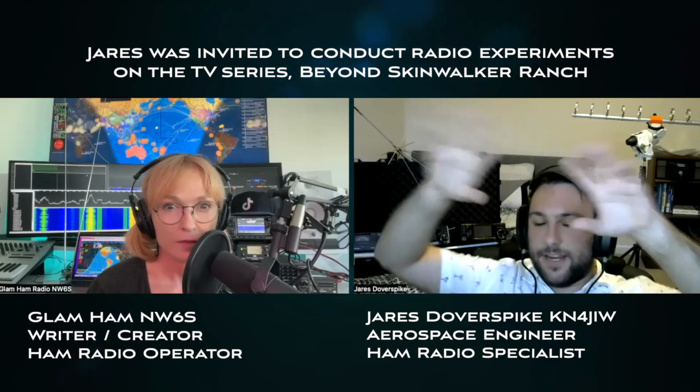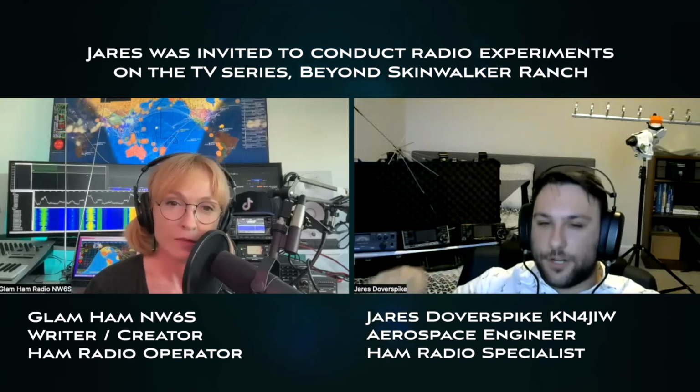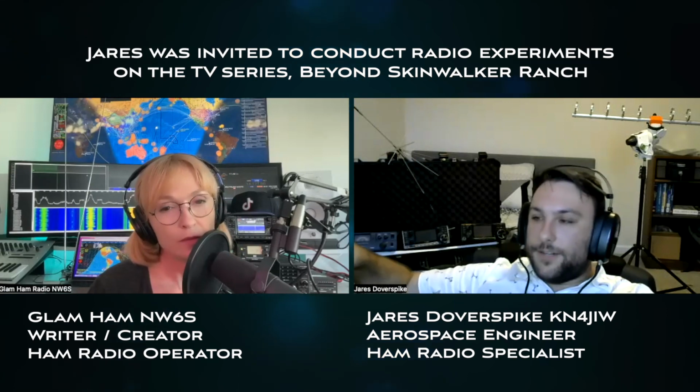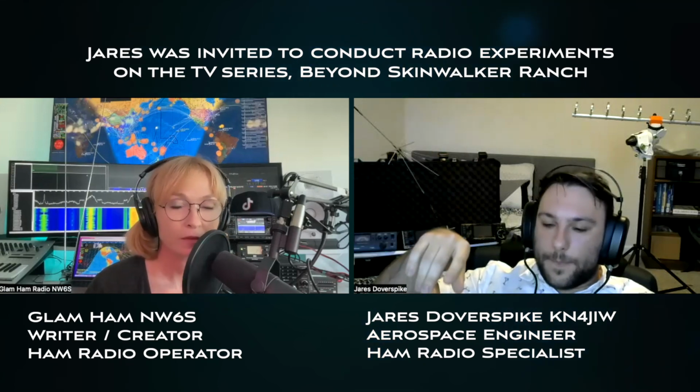I saw your standard kind of spurious signals. I saw a couple of what I would assume to be satellites because I was seeing the Doppler shift. Like, if you zoom out a little bit on your RTL SDR, sometimes you'll see different signals that go one direction, kind of flatten out, and then move in the other direction. More than likely, that's a satellite. But I was seeing just what you would normally expect to see. And then I called CQ for it, didn't really see very much.